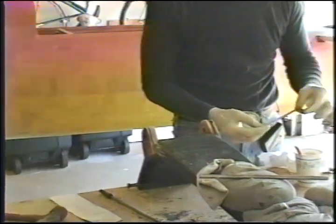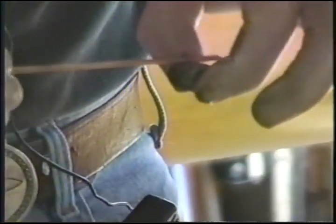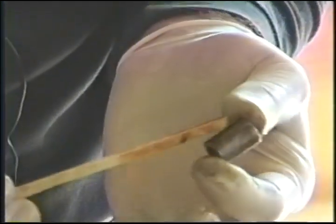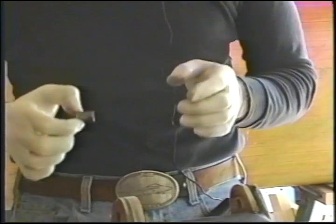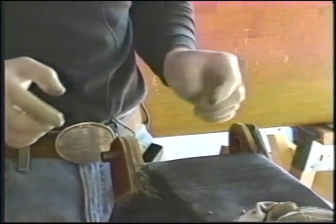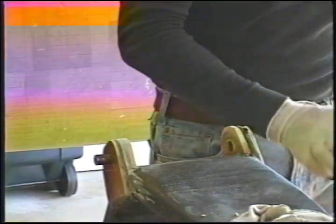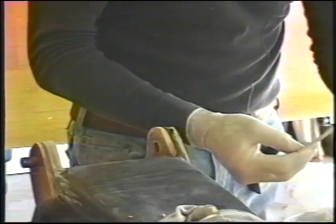Okay, now, I didn't use a brush. This doesn't really warrant a brush. Just going to smear the bushings exterior. I just sanded these moments ago. Did I mention it's been beveled on one edge, Chris? Okay, yeah, I beveled one edge so that it doesn't grab as it's going in. You can see how that first section goes in pretty smoothly right there. Now I'm going to put both bushings in at the same time for the purposes of alignment.